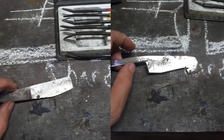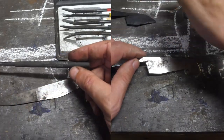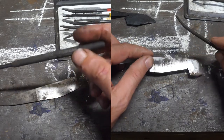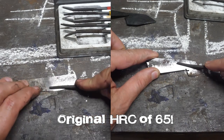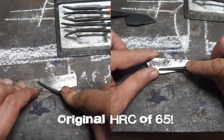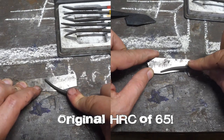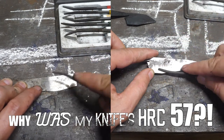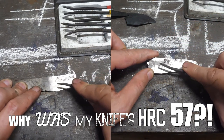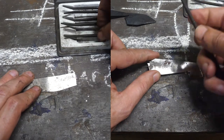Let's clean up and hardness check these two blades. I've ground off the rust because we can't hardness check that — and oh my gosh, these are both 65 HRC, maybe a little more, maybe a little less. I cannot believe my eyeballs. They're the same hardness near the spine as they are at the edge, which tends to reinforce our monosteel theory, but that hardness is nuts. Why did my final knife turn out to have a hardness of only 57? These are almost eight or nine points higher. Why are kitchen knives 65 HRC? Japanese kitchen knives usually aren't that hard.